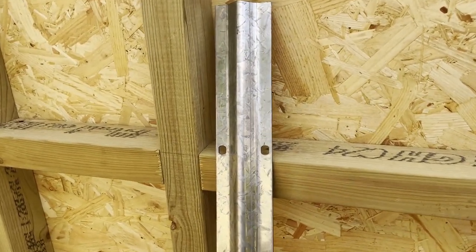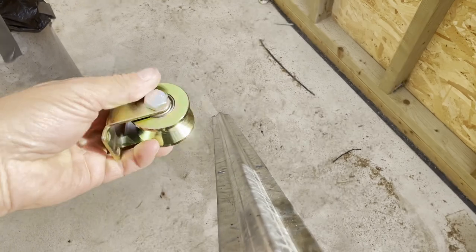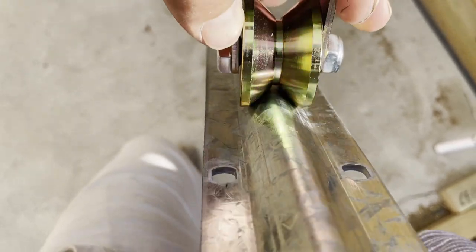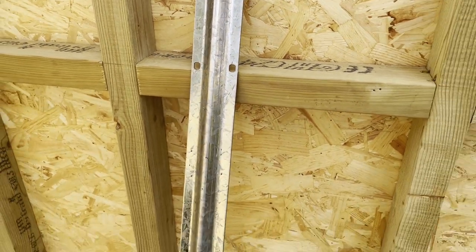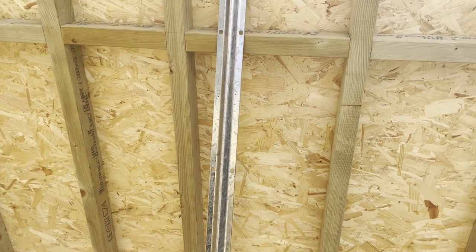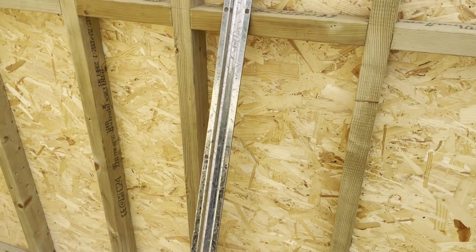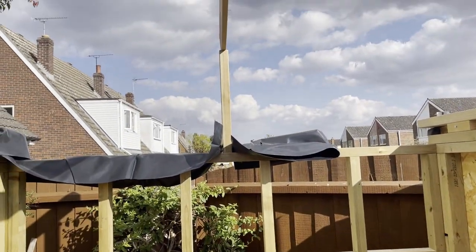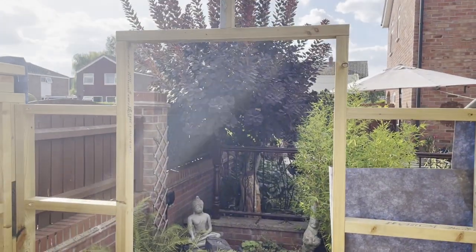This is the track — it's a 20mm V-groove, you can see the shape. The wheels I've got are 50mm V-groove wheels and they sit nicely on there. They're very quiet and smooth and should work nicely. I've bought eight pieces of track, giving me up to six meters a side — way more than I need as I only need about five meters. I've got eight wheels, so that's four each side. This will all be in my next video: building the roof, finishing the gable walls up to the underside of the roof, and hopefully installing the door.